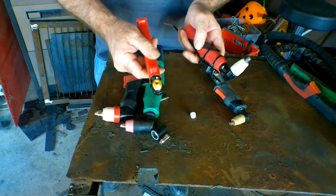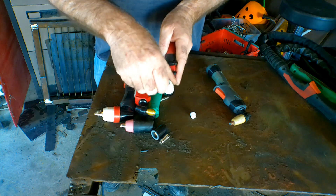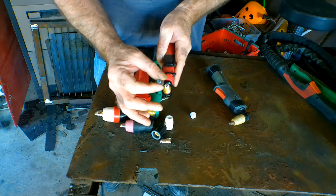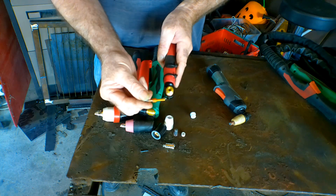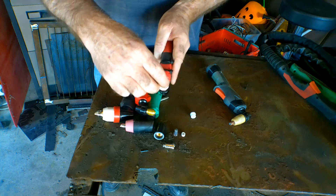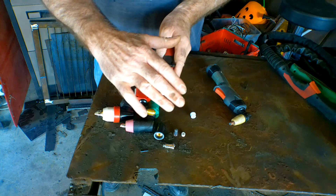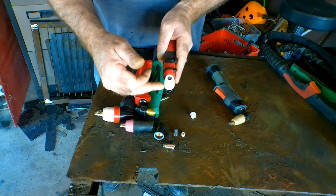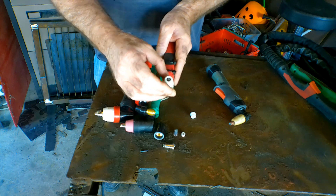If you compare the SG50 here to the PT31 here, we take this one to pieces and look what we find. This is just pushed on there and it's sitting on a swirl ring that holds it apart. Basically, we've got a double-ended electrode and it just sits in here. So what you have to do is screw this up really, really tight with all your fittings in the right place for it to hold it down so it doesn't start vibrating. The minute this starts vibrating, it'll start cutting into your torch head. And then within two or three hours, your torch head will be buggered.